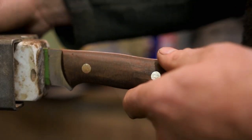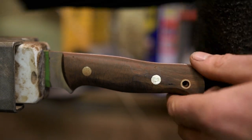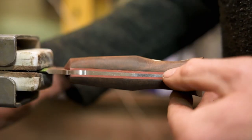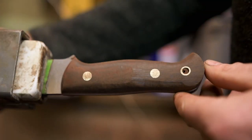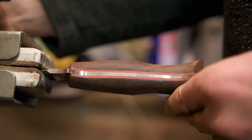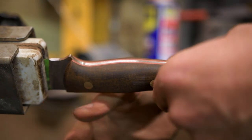I'm just working on this handle on this camp knife. I finished it on the grinder — you can see all the rough grind scratches. I've got a hole to fill there. Unfortunately with natural wood you've got to work with whatever the material's got. This is desert ironwood. I've put the rough handle profile in, as you can see the hourglass figure. I'm just doing some final shaping.